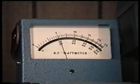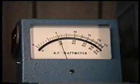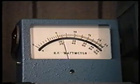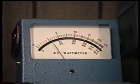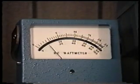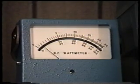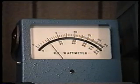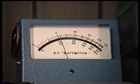Now this radio that I'm using actually has the problem that I'm describing. At the present time it's working, and this is one of the characteristics of this problem, is that many times the radio will appear to function normally, and when you try to use it for sustained periods of time, the power level will suddenly drop. And just a few minutes ago I was testing this radio, and that's what was happening. But at the present time it is working, so I'm going to simulate the condition by turning the power level of the carrier control lower on the front. This is what you'll see when you have this problem.